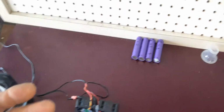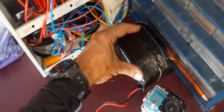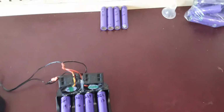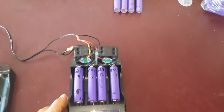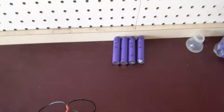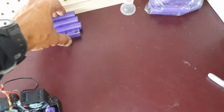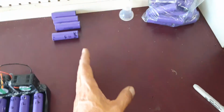So a lot of times in your power tools, they'll usually fail because of the actual BMS chip, the battery management system chip that's in there, that regulates each and every cell. So this is how I single out my batteries, and then I put together, if you go on some website there, Cell Packer or something, and like that you input each capacity for each cell, and it actually puts together the recommended cells in each series pack. So I'm gonna have a 14S, so 14 cells in series, and then 6 in parallel. So that's how we're going to be putting this together.